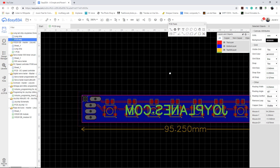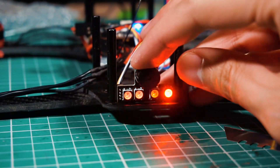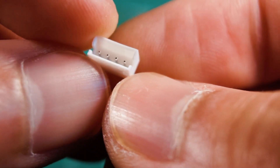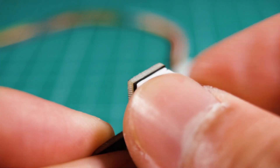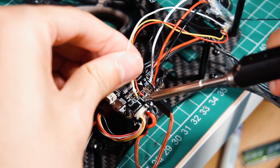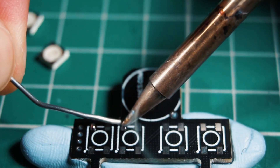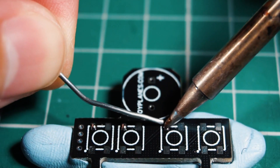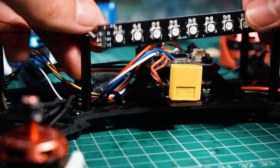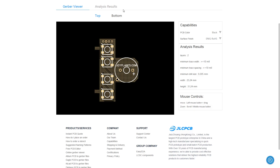Making the schematic for these designs is very simple. I took some measurements from the frame to make the PCBs fit right in place. The rear PCB will also have a buzzer, which makes loud noises to indicate modes of the drone or when it is lost. An interesting characteristic is the connector — it is a 4-pin connector, which is way easier than soldering. For this first version I have designed two PCBs: the rear one and the side ones. This first version still has some errors but it works great.